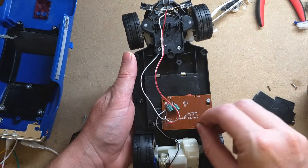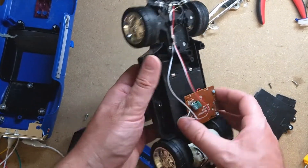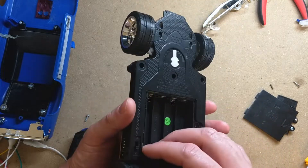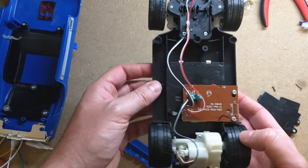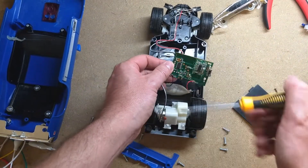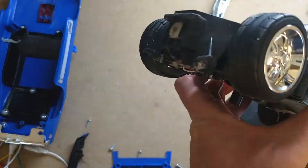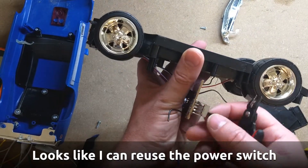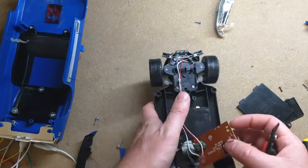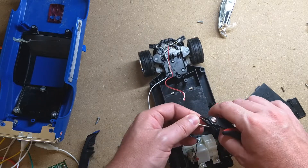The basic idea is I'm going to get the signals from the wireless antenna from the controller — this controller controls the wheels, so this goes. So we'll take this board out, and then we'll have access to the power back here. That's probably where we'll hook directly into the battery, and hopefully the switch will still work so we can just turn it on and off. There are the power lines — voltage and ground. So we'll strip these ends here so we have access to these wires.